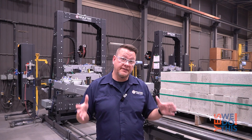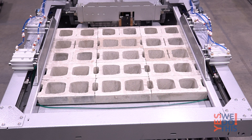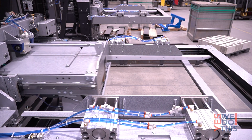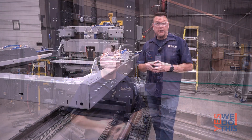They also wanted 1,300-pound side compression from all sides to really squeeze the bricks altogether before being strapped. For that, we designed a compact pneumatic compression system, which also doubles up as a strap guide to maintain the strap level as it's being applied.